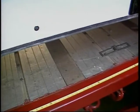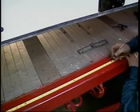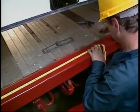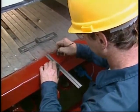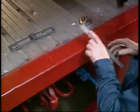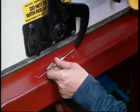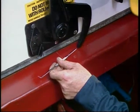In order to properly position the latch plate, first raise the door slightly and measure the center line point between the posts and scribe a mark on the sill. This will be the center line of the cutout. Using the cam as a guide, mark the sill where the center of the cam intersects the scribe mark.